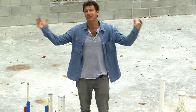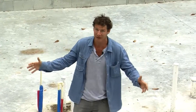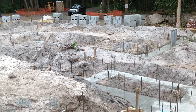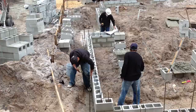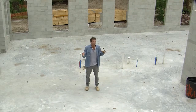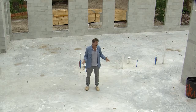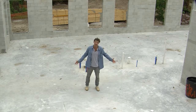One thing I love is progress, and as you can tell by this concrete foundation, we are making progress. The first thing we did was we poured our footings. Then we built the concrete block wall, and then we poured the slab. Down here it's slab on grade, otherwise known as a mono slab. In Florida where the ground doesn't freeze, it's always best to go with a mono slab, and I think we made a good choice.